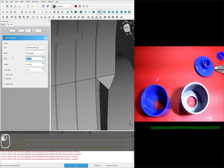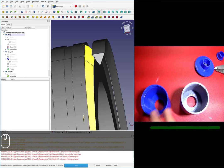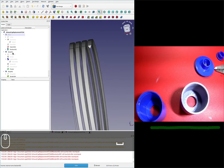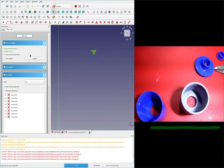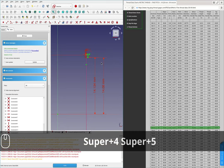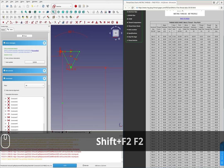Boolean is additive pipe — maybe we forgot to change this to 1.5, that's probably why it was looking so funky. Let me hide this body, edit the sketch, and look through the dimensions. For this small thread, I recall taking a look at this — I'll try to pull the dimensions off the actual model first. Lining up my calipers with the edge — 29.5 appears to be about the depth of this thread.